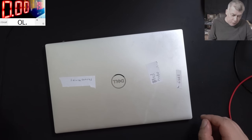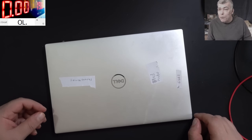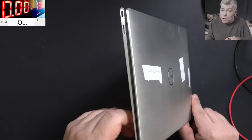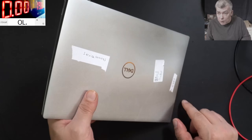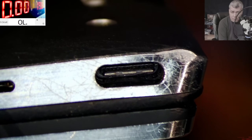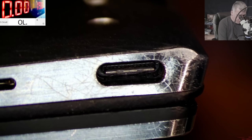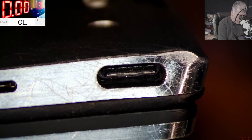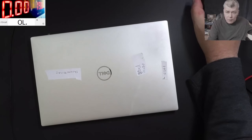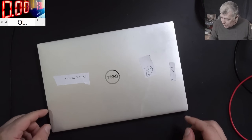So we are looking for an input circuit issue. What I will check first — let's check the charging port, just to be sure the charging port is good. For me the charging port looks fine. I mean I can't see any issue with it. Probably you can't see because the case is shiny, but I can see the port looks fine. So let's plug a charger and see what it's doing.